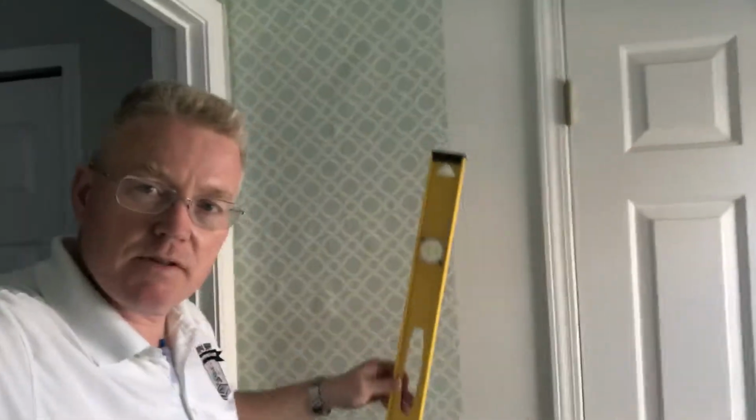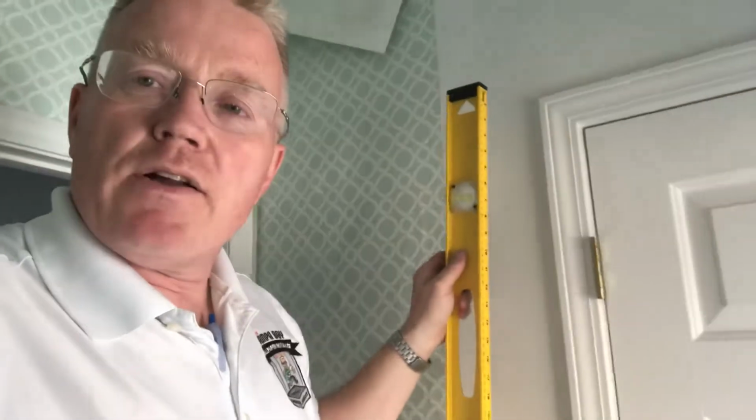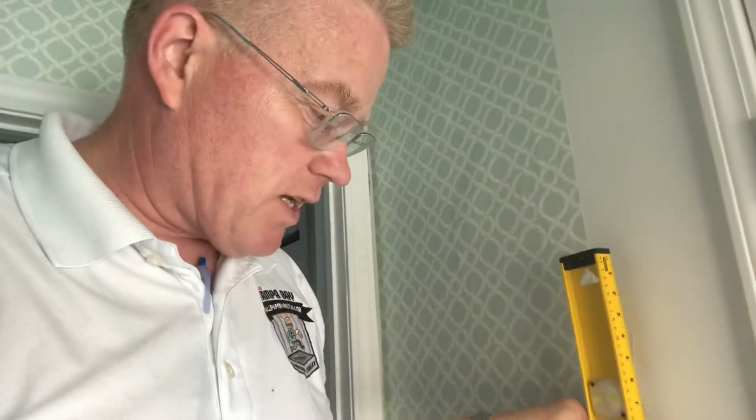Well, here's two little tricks that I'm going to teach you now that I hope you follow so that doesn't happen to you. Number one, use at least a 3-foot level. This happens to be 4, but I want you to use it in 2 places on the sheet of the wallpaper. Let's say you have a 12-foot ceiling. Well, then you want to get yourself a laser level, okay? But if you're using this, which is the basic tool, now yesterday I did a video on a laser level, a new product that I introduced onto my channel. But on an application like this, the first place you want to check is right in the middle.